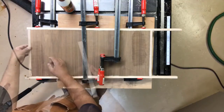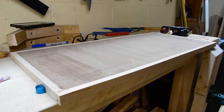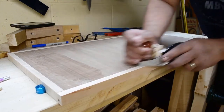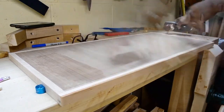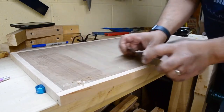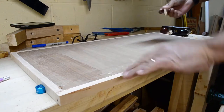Once the first end is in place, we'll repeat everything for the opposite end, and then we'll finally clamp them in position. Now that everything is dry and the clamps are removed, I cut the long strips to length, and then I turn my attention to bringing them all down to the same plane as the walnut. This step involves using my block plane, which I hold on a slight skew for easier control, and then quickly remove all that excess material, stopping frequently to feel and look at that mating edge. As we get closer, I switch back and forth between the block plane and a card scraper to help dial in that final dimension until I can feel it's right where it needs to be. Once that's all done, I'll eventually sand everything smooth and blend away all the blemishes.